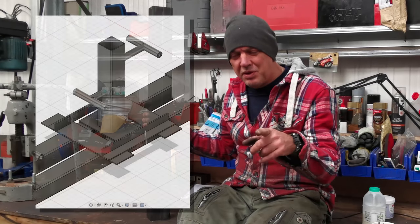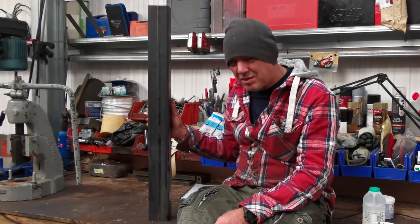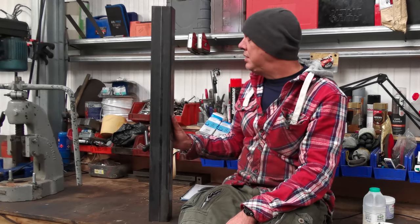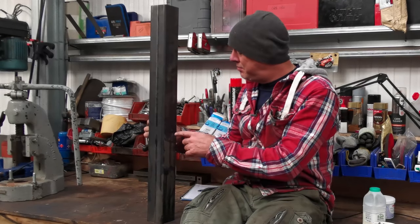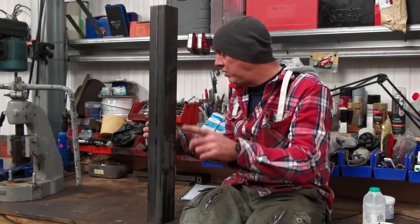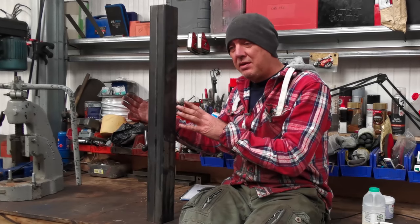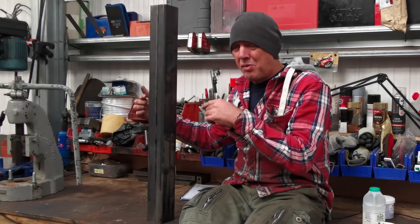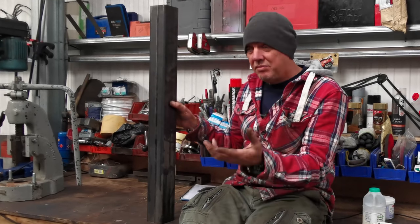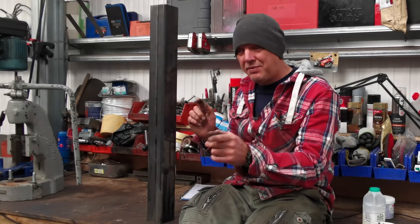Then if you have a look at the engine bit, the one in the middle, that looks really weird. I've got like eight points on this, I think. One, two, three, four on each side, basically. So there's going to be another one of these with another collar, and I'm probably going to drill it through, sort of in line with them or off to one, whatever. But we're going to have bars that come through with a plate on the end, and that's going to be the pickup point. So it'll probably just be a bar with a hole that's threaded. And off that, that's where the engine mount is going to be. And I can come forwards and back on this, and I'll basically just make this to fit that engine.